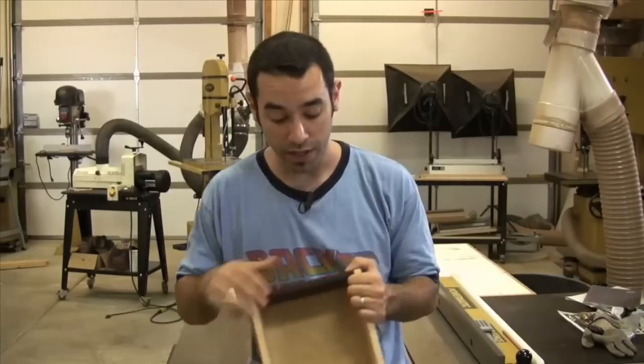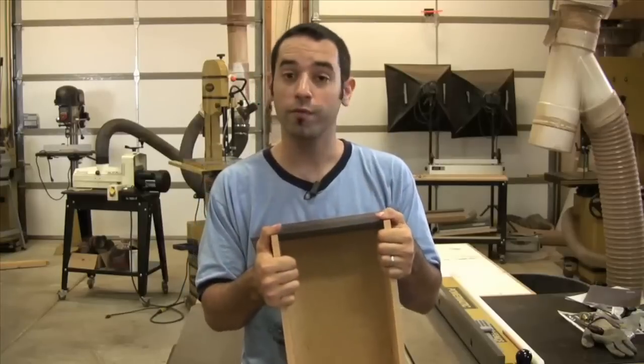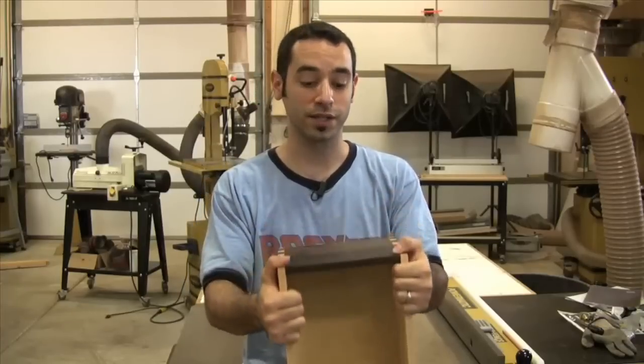And the mistake that I made was I sort of made a rule in the beginning of the podcast that said, you know, for your drawer fronts, you always want the pins, and for your drawer sides, you always want your tails. That's absolutely true. And if you look closely from here on out, you'll see I did the exact opposite. Not intentionally, I just probably picked up the pieces and I was so focused on filming the podcast that I just wasn't paying enough attention.